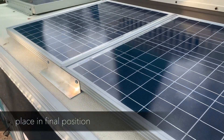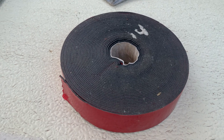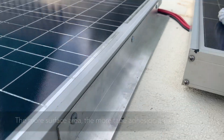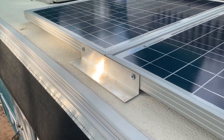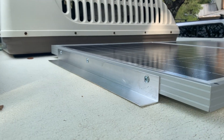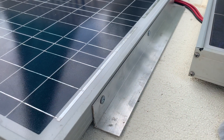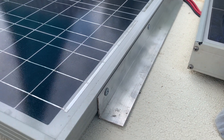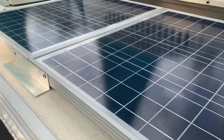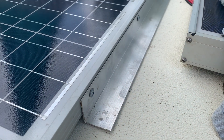Next step is to line these panels and apply the tape. For me, surface area is king. I'm going to get a 20-inch strip on this panel, a little 8-inch strip on the side, and another 20-inch strip over here. I'm going to clean everything with alcohol - since it's COVID and there's no rubbing alcohol, I'm using Everclear. We want to get rid of all the dirt, grime, and oils on the aluminum and surface so we get really good adhesion from the glue.